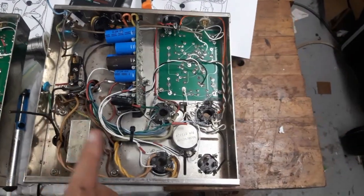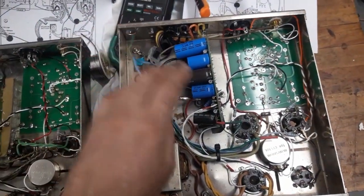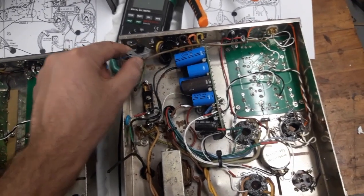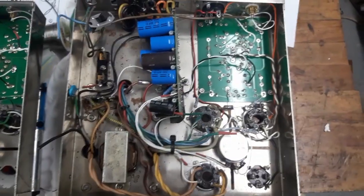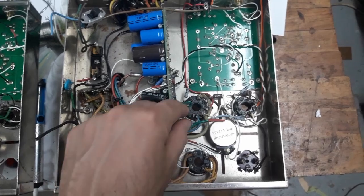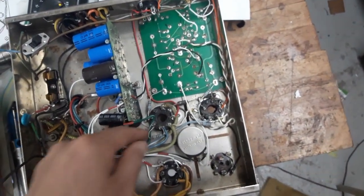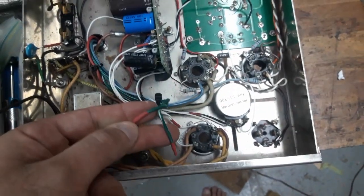This one is the amp that I got wired up, not completely, because again this is also missing the power cord, and this is not hooked up properly. What I found with this, funnily enough, I'm not even sure if this seller knew this, but this was wired for triode. If you see this loose wire here, and another one tucked, yeah, here, these two wires, these are the wires that make the amp ultralinear, right?